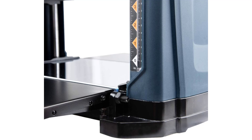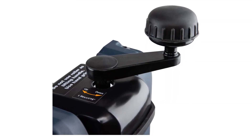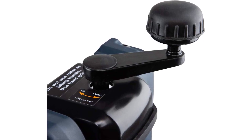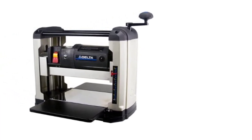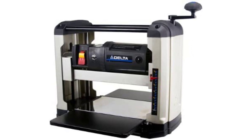I love this about it, especially when you are just a beginner, as it means you feel you can trust the machine. In addition, this model also cuts down the risk of encountering that dreaded snipe. If you are new to a planer, snipe means it digs deep at the start resulting in gouging. This machine seeks to counteract this, which is always appreciated.